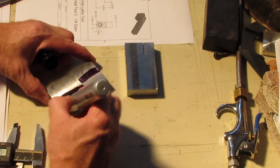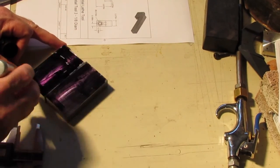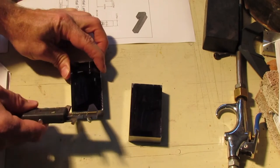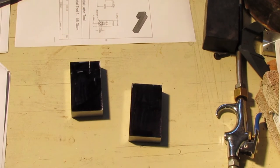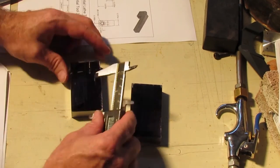First, I tried using only calipers to scribe the lines, but they ended up being too faint and difficult to see. Still using a wide Sharpie marker as a substitute for layout fluid. As I start more machining projects, I will have to look at buying some Dykem steel layout fluid.